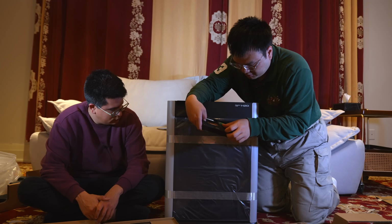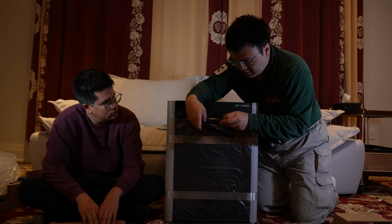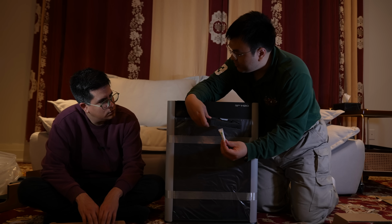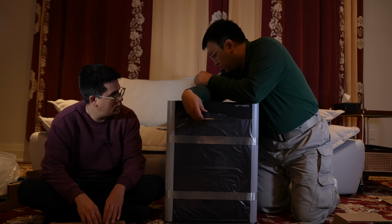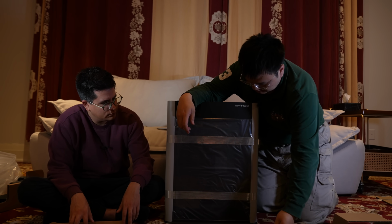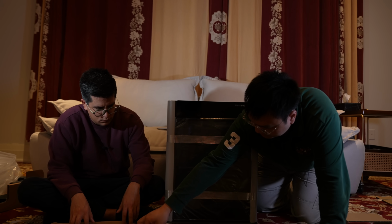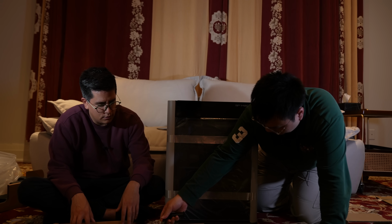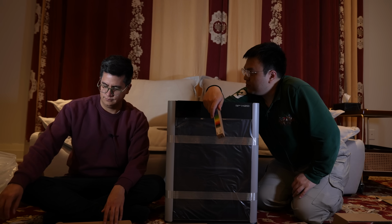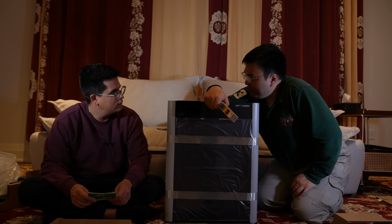That's for when you change color, it will cut the filament. And hex pins, screws, spares and stuff. What is that? Lubricants. So whenever it tells you to service, you can use these to lubricate the rails, screws and stuff. Pretty nice. PTFE tubes and a dry bag for the AMS system. And this is for when you are not using the AMS, you just hang a spool beside the machine. This is interesting. It did not come with this when I bought the X1C. It came with the P1S and the X1E, but not with the X1C.